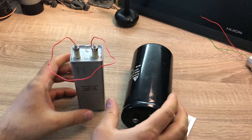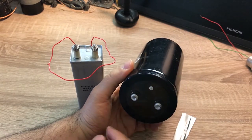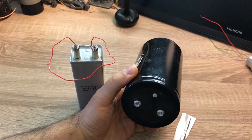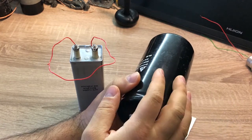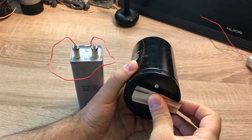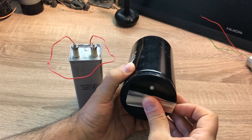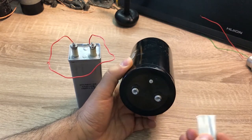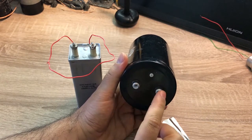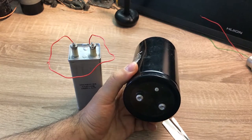The reason for this is: imagine you have a capacitor and you apply DC voltage to the terminals, you use this capacitor for a while under voltage, and eventually you want to discharge it. So you discharge the capacitor completely — all the charges on the metallic plates are gone. But if you then remove the short, gradually a potential difference will form between the terminals of the capacitor. We call this recovery voltage.